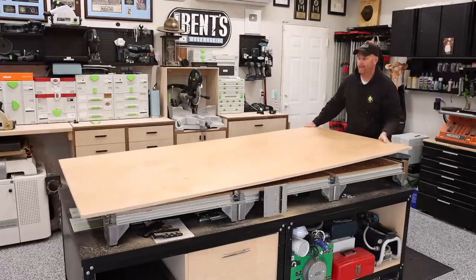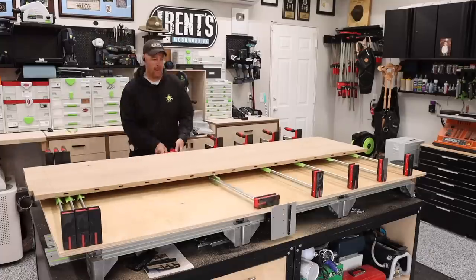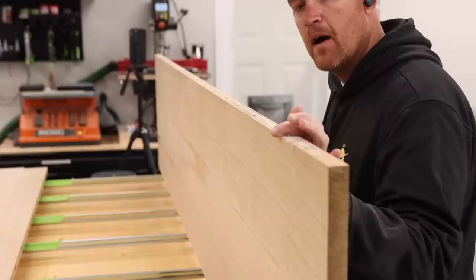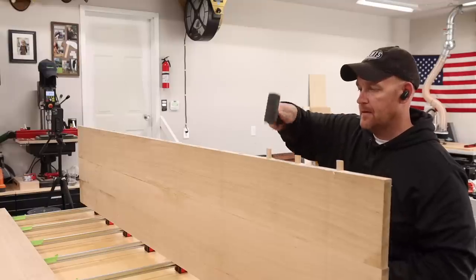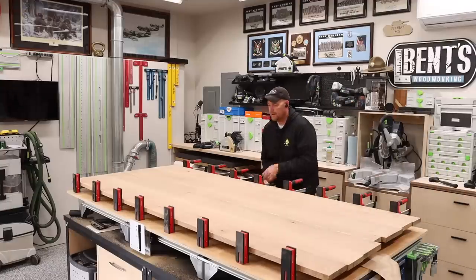This table is a total of 42 inches wide, which was just barely too big for me to get clamps underneath it. My solution was to use a base of a 4x8 sheet of plywood underneath for the support I needed. I applied some glue, whacked in some dominoes, and clamped the two pieces together — really nothing surprising here.